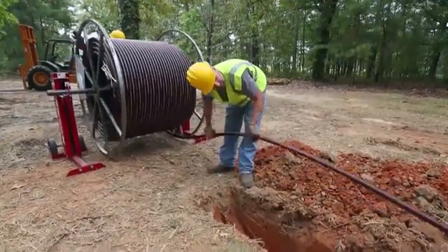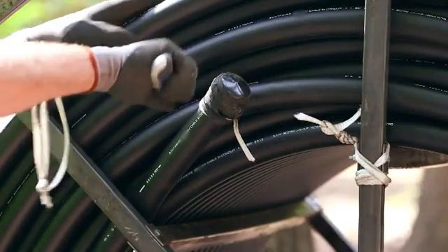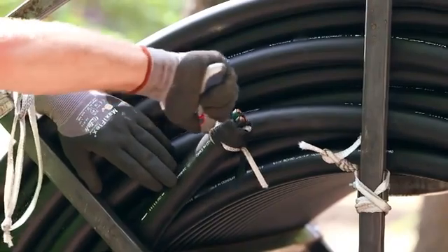Because of the length difference between the conduit and the cable inside, it is very important to first cut the duct free of the reel flange, remove the end cap, and cut the restraint attaching the cable to the conduit. Once the cable has been freed from the conduit, replace the end cap and seal it with tape.